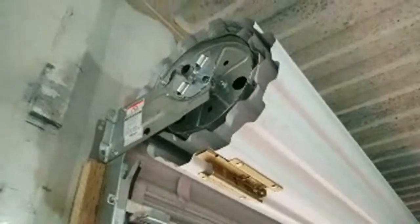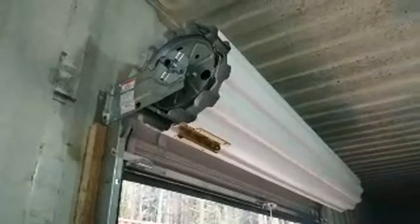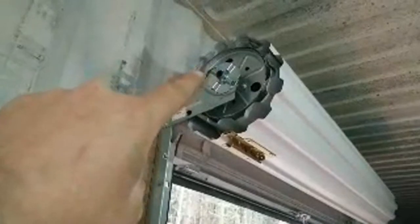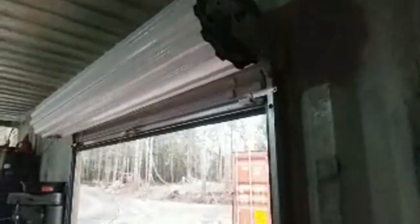This particular roll door, that's how you tighten the spring. It's got a little latch right there, so all you do is stick a pry bar in there and you turn it and it clicks, right? So you turn it as many times as you need, until it's tensioned right, and then you just stop. And it's got a little stopper. You can see it right there. And this side, you can see it's just got a washer holding it on, one of those one-way washers that you just push on. It's so easy to install. And then I just added this plate today and painted it. I believe this plate is actually supposed to go the other way, so the water drains out. But when it was the other way, it was too tall, like the bump, and the door wouldn't latch. So I put it like that, and I actually really like it like that better.